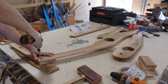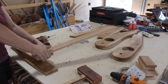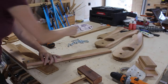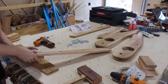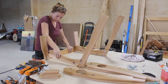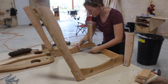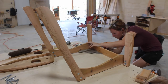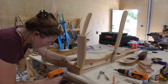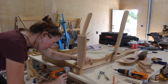Next, I repeated the process to connect the bottom support piece to the back support piece. Again, since I have two holes here, I drilled one, placed a bolt to hold its position, then drilled the second. To join the two assemblies together, the bottom supports connect easily to the front assembly. I use a speed square to make sure they're being attached square, then hold them in place while I pre-drill with a countersink and drive in a screw. I always pause my music so I can listen and make sure the wood is not splitting as I'm driving in the screws.